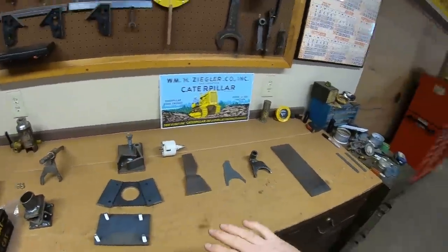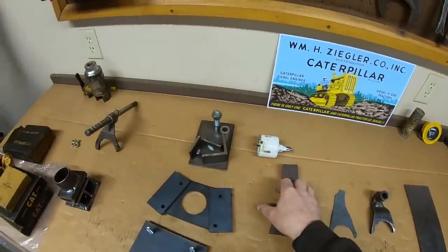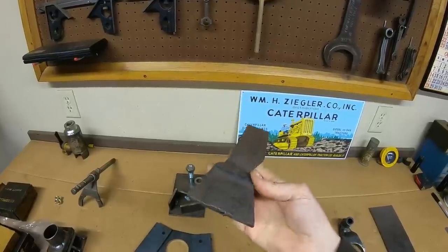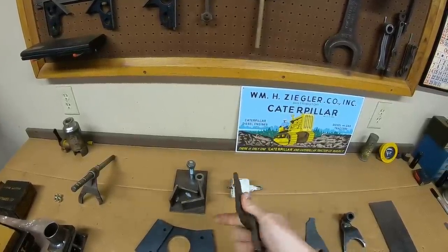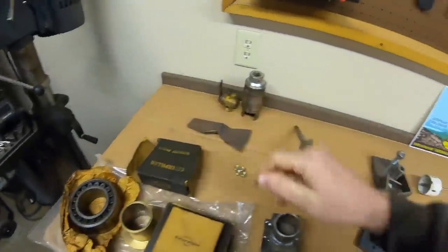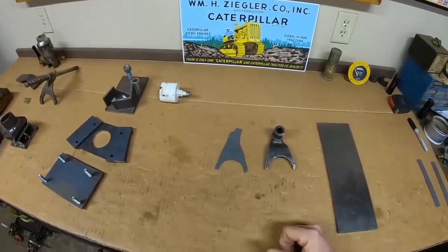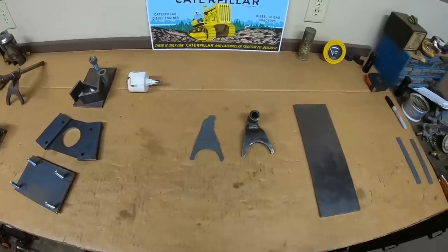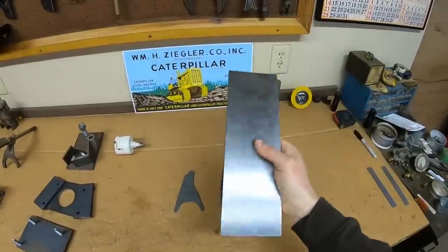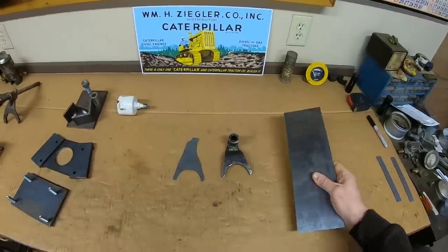This is about the time this tractor had pretty much beaten me last time. I was suffering burnout on the job and I needed a piece of 5/16 steel to make a new 2-3 shift blank. I had one on hand but it had a pitted surface — and I was in the 'good enough' stage at that point, and that's not good enough. So I've decided to write that blank completely off. I ordered up a non-pitted good piece of the appropriate 5/16 steel from McMaster-Carr — enough material to do two attempts at a 2-3 shift fork blank.